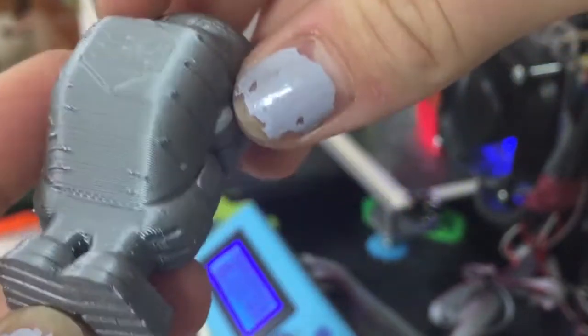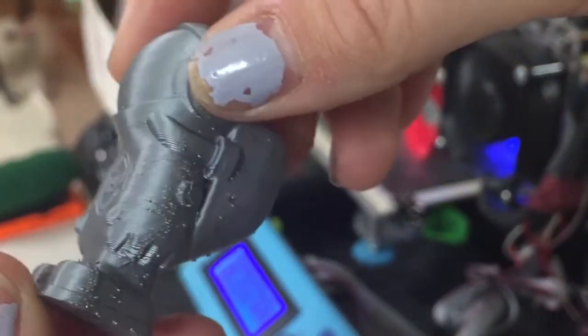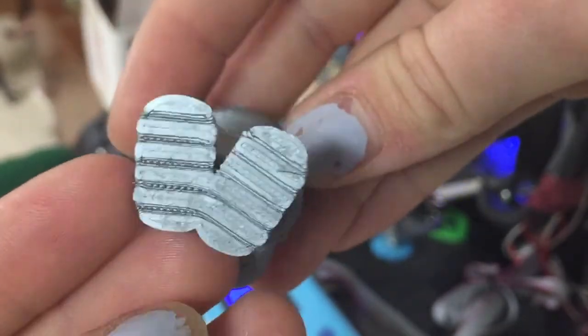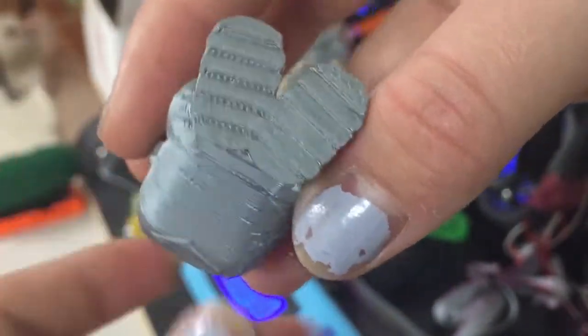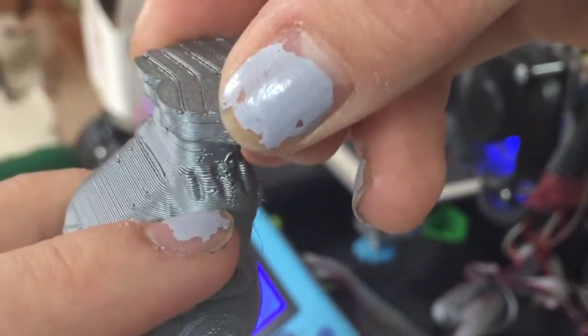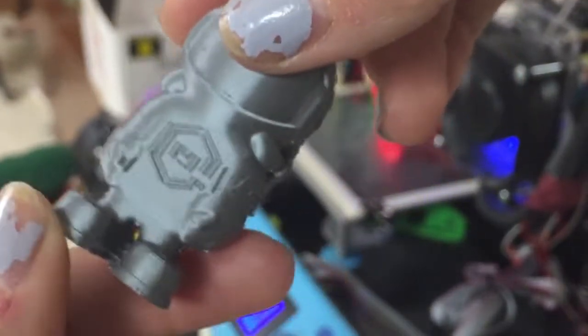Next, what we have here is a little 3D fill. This was a pretty cool print, just like all the other 3D fills I print. This was printed right next to the 3D Benchy, and as you can see where it transferred back and forth between the Benchy and the fill, it didn't do very well — it left all this beading. The bottom layer did okay, but there's a little globbing here, and this was the one I had the most problem with sticking to the bed. The overhangs on the hands didn't do very well — they usually do great on most filaments, but not this one. This is 20% infill, so they should have done better.